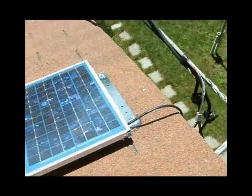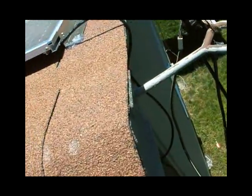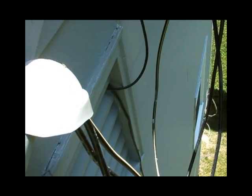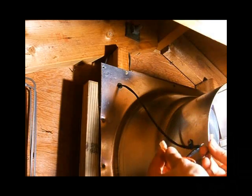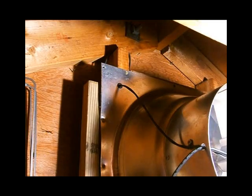The power cable attached to the PV module is outdoor rated. I routed the cable over the edge of the roof, anchored it to the flashing, and sent it in through the gable vent as mentioned earlier. Be aware of power lines and other cabling in the area — not only can they be dangerous, they can also shade your solar module. Back inside the attic, I closed the circuit by rejoining the spade clips I'd pulled apart earlier, and the fan started up.